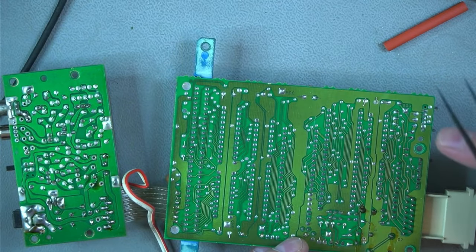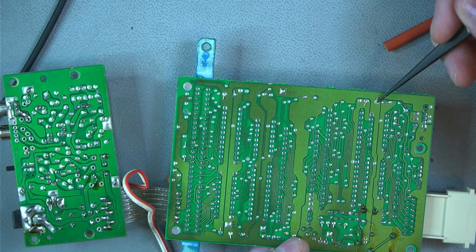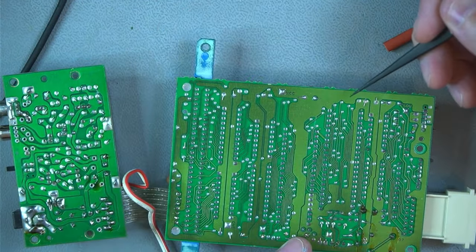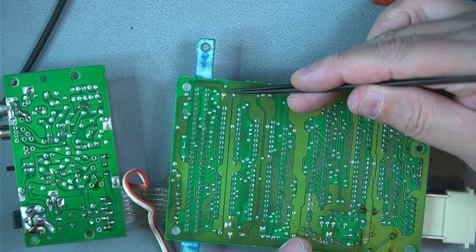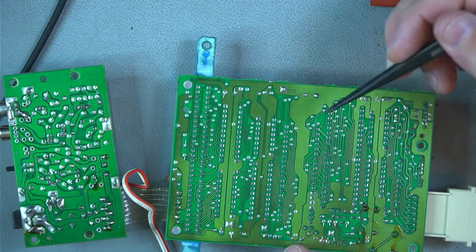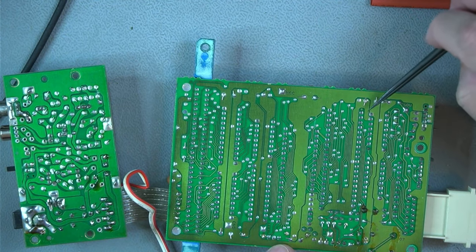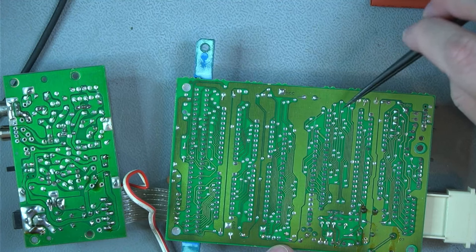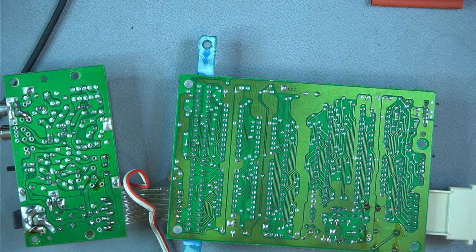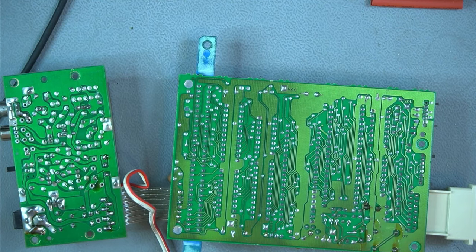People also add some filtering between 5 volts and ground on the CPU, but this cap here will take care of it. I'll do that off camera because this video will be way too long. I'll show you the result. Make sure the polarity is right: positive side to pin 22, negative to 20, and then have a look at where VCC is — that's plus — and where ground is. That should be good.